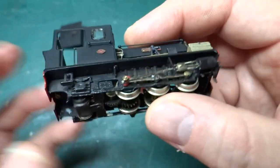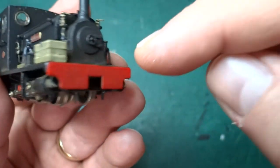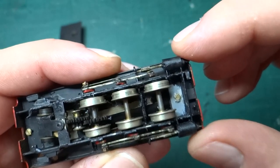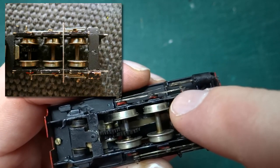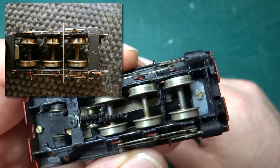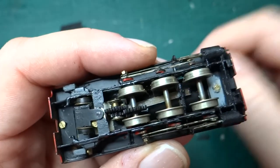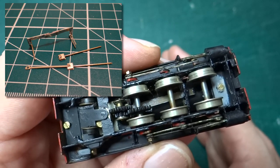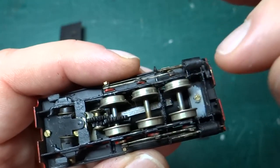That wasn't the only problem with the slide bars. They're one piece — the slide bars, then this upright, which has a piece that passes all the way across the chassis forming the other upright and the other slide bars. But when viewed from below, the original piece had the slide bars too close to the wheels, which meant all the motion behind the slide bars couldn't pass through the gap. There just wasn't enough room, no matter how much you thinned the nuts and washers. So I cut it in half, moved the two parts apart slightly, and soldered another piece on to join them back together, moving the slide bars out just enough to create some space behind.